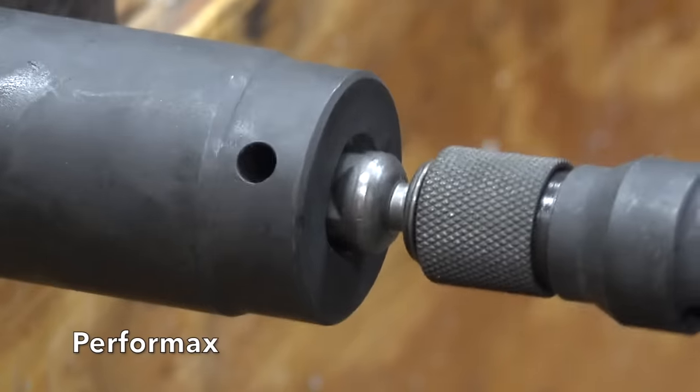The Milwaukee seemed to struggle in round one and also struggled here, making only 700 psi before breaking. The Masterforce broke at only 850 psi, which is slightly below average. The Makita Gold did by far the best in round one and broke at 1,250 psi — unlike most other brands, the shaft didn't seem to twist too much before breaking.